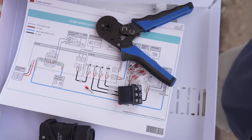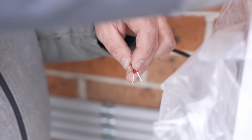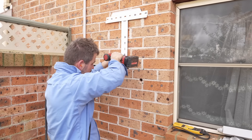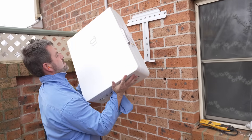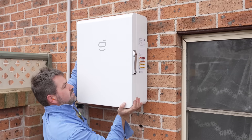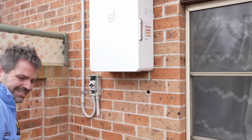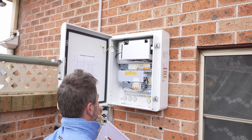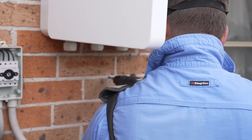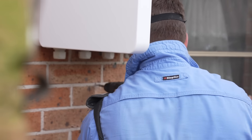I was really amazed at the level of detail and wiring that goes into these, particularly when you start getting into the switchboard. One criteria I had for the battery is that I wanted it to allow for complete backup off-grid - I wanted to have our house able to be powered regardless of whether or not there was a power dropout. And this is what the gateway does. The gateway has a super fast switchover from battery backup to the house if there's a blackout from the grid. And I know there are some solar systems out there that if you have a blackout, you actually lose all electricity - doesn't matter if you've got the sun shining or not.